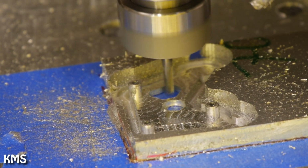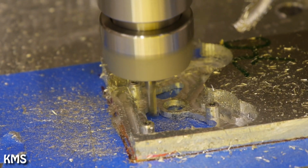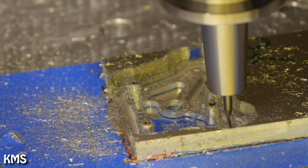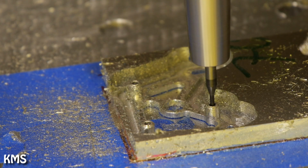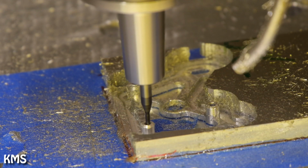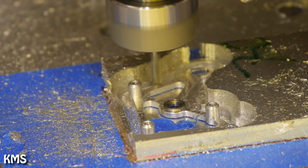The main material removal here is done with a 2-flute 4mm end mill, and it leaves quite nasty surface finish while roughing. I later switched it over to a 3-flute, which has a significantly better surface finish. And as you're seeing, I removed basically everything beside a small area on the side, and this gives me enough holding force for all the sequential operations like thread milling. And the last operation then cuts it free.